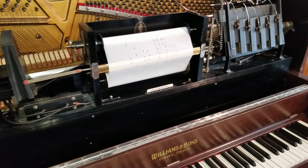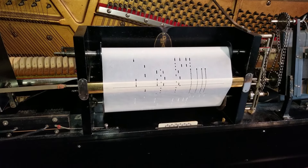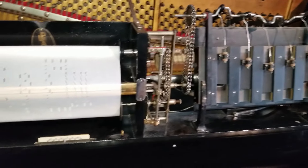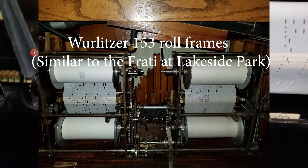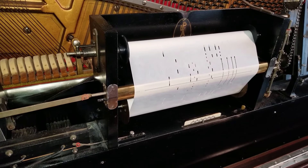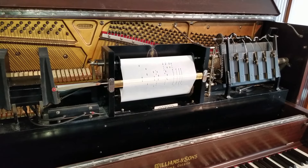That's basically it. The way this works applies to some other mechanical instruments as well. The band organ at the Lakeside Park Carousel, for example, has a Wurlitzer player system in it. The mechanism to make the roll spin is completely different on those band organs, but the actual mechanism which makes the notes play is fairly similar. It has a tracker bar, a roll, it works with suction, it has valves and uses a pneumatic actuator. But instead of the pneumatic actuator pushing on the piano action, it pushes down on a pallet valve, which opens the airway — essentially like pushing a key on an organ. So it's the same principle. I hope that clears up any questions you might have about player pianos or similar mechanical music instruments — thanks for watching.